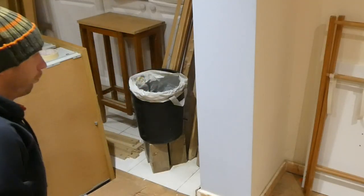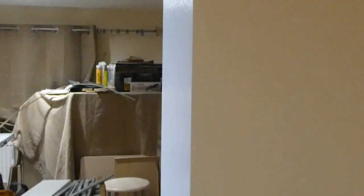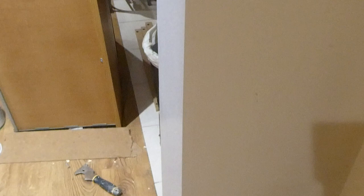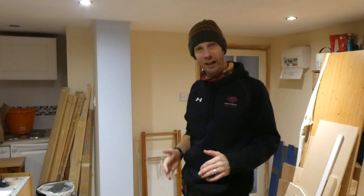I've now got a lovely one-face blue column in my basement — just check that out. A real straight line all the way down there, and the same on this side. If we go beyond the corner you'll notice not a single bit of blue is on this side wall. That is how you paint an external corner two-tone or in two different colours: no masking tape, no getting the roller too close to the edge, no overspill of paint onto the other side — just a lovely sharp flawless straight line right down that corner.